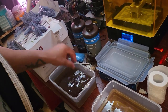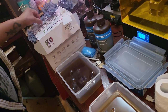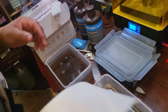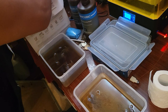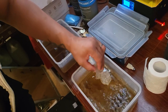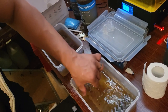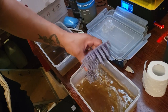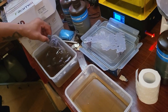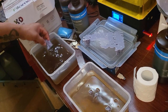I like to put them base first because crud does tend to sit on the bottom of the stations. If the actual model touches the floor of the cleaning station you can end up with sticky stuff on your models, which is no good. The second stage bath is nice and clean, so this is just to really clean them off. I will do another video on how to manage these stations, because you can reuse your isopropyl for ages and ages. I've had a 5-litre bottle of isopropyl going for probably about two years.